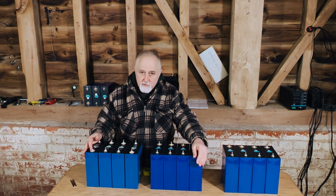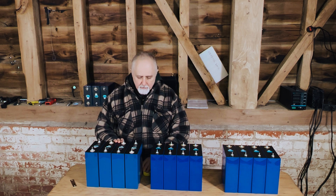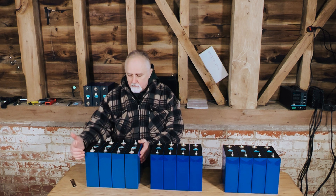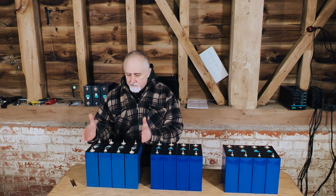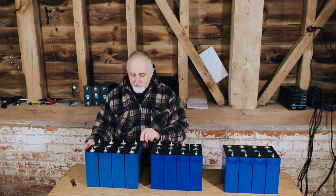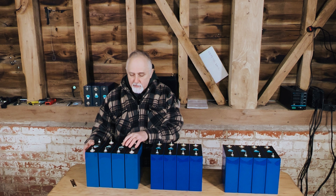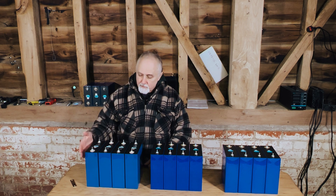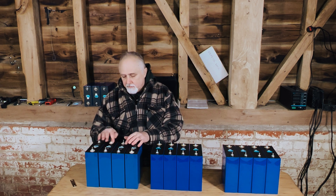The long and the short of it is that when you buy from an unknown supplier to get a really good deal on AliExpress or Alibaba, this is the kind of risk you take. You could put these into an enclosure and compress them with threaded bars — like I showed in a detailed episode on building a DIY battery — and the thread bar would keep things together. But the high degree of swelling indicates a potential quality problem, which a lot of people on forums and various experts would agree with. We tested these out and they weren't too bad in terms of capacity, but due to the swelling I would not recommend them.